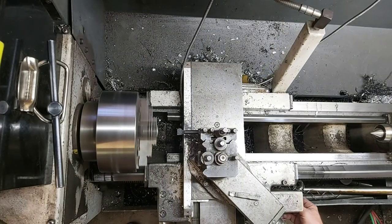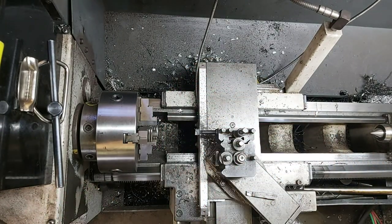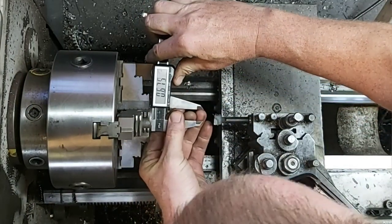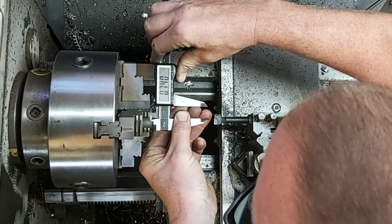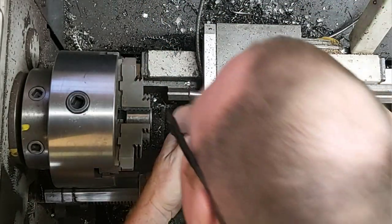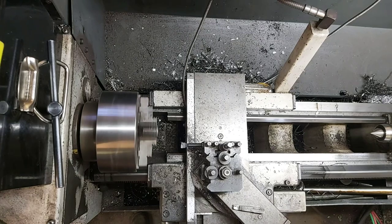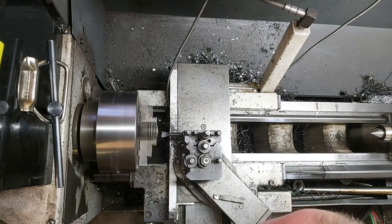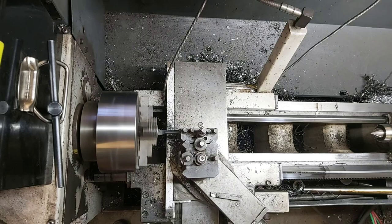What I've done here is bring the inside bore size to the same size as the shank of the chisel. Obviously the two aren't going to fit together if they're the exact same size, because there has to be clearance in there. So now we're about to come up on taking the final pass on the bore, and this is where everything has to be right. Everything leading up to this moment was pretty much a practice run for the final cut. Listen to the lathe and the song that it's going to sing — this is more of a happy song that's going to give you a really good surface finish and a lot of happiness in the end.